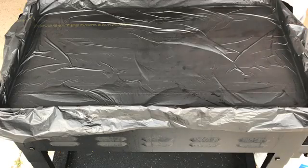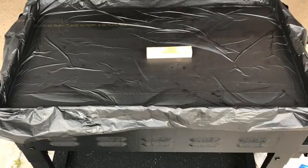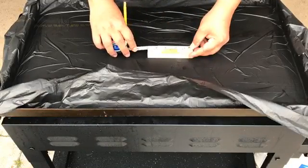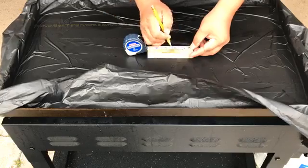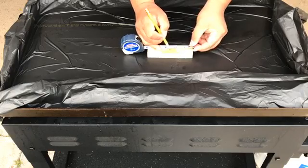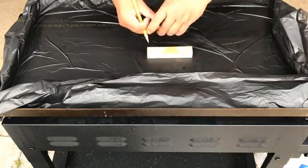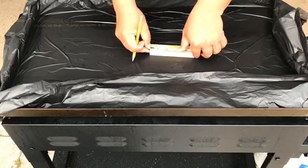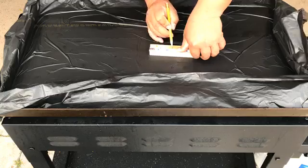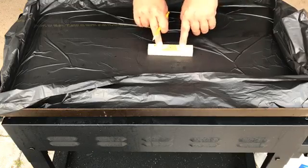Okay, before we deal with the pan, let's work with this wood. Okay. The best thing to do is find the center. This is a 5-inch, so the center of it is 2.5 inch. Okay, and then from there you're gonna find the center between the end and the middle, which is gonna be 1 1/4, which is right here, and then the same thing here, 1 1/4. Alright, so between the end and the center piece is 1 1/4. So it's right here. And what we're going to do is we're going to drill a hole for the knobs.